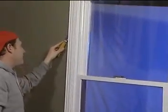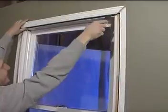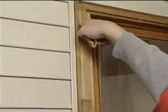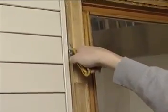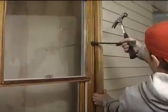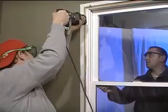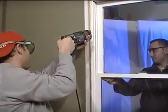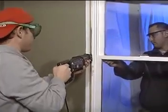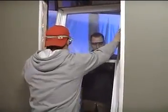Now cover the entire work area with drop cloths. Score outer edge of casing trim and remove all molding. You will need to cut or break off the caulking around the brick mold and remove it. Cut out any mullions. Now, using your reciprocating saw with a long bimetal blade, run the saw between the frame and the stud wall. Cut any nails or screws, releasing the frame from the wall, and remove it.